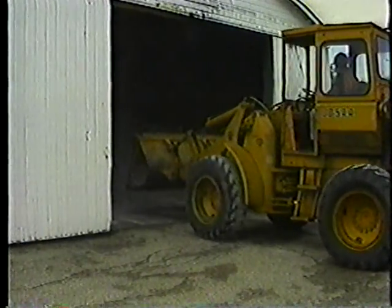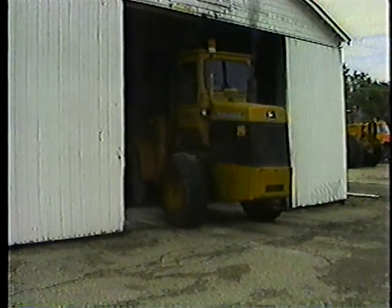You'll also have to work stockpiles of the salt used for snow and ice control — the procedure is the same. But the stockpile is usually stored indoors in a salt shed, and the problem is clearance. The bucket can easily reach the rafters in the shed. You've got to keep the entrance to the shed clear — if material builds up in the doorway, it cuts down your overhead clearance.